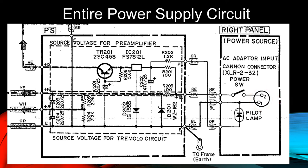The next component in the circuit is the on-off switch located on the side panel, indicated by an orange circle and arrow. From here, the plus DC voltage travels through the red wire on the slide switch, then on to the internal regulator board. The zero volts ground is connected to a black wire, which is also connected to both the internal regulator circuit board and the metal frame of the harp section. This last connection is indicated by a green oval.